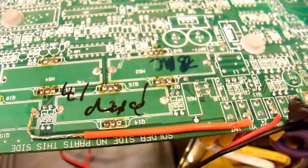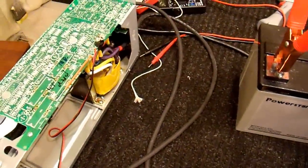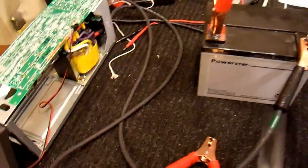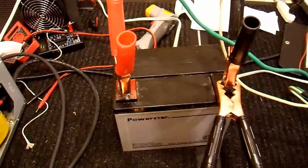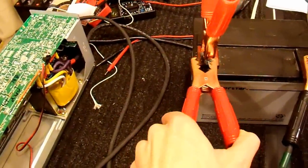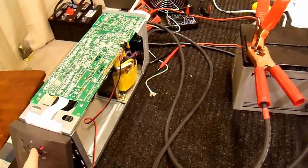This wire clearly can't carry 65 amps, but it only needs to support the trace somewhat, so I'll see how that does. If it stays below 100 Celsius, I'll consider it good enough. It's time to see if replacing those transistors actually fixed this. I'm not sure that only those four were bad — the other four could also be bad. I ohmed them out and they seemed okay, but that doesn't mean a whole lot. I have my load plugged in, it's off, connected to the battery with my charger on it, and it's time to hook this thing up and see if it explodes.